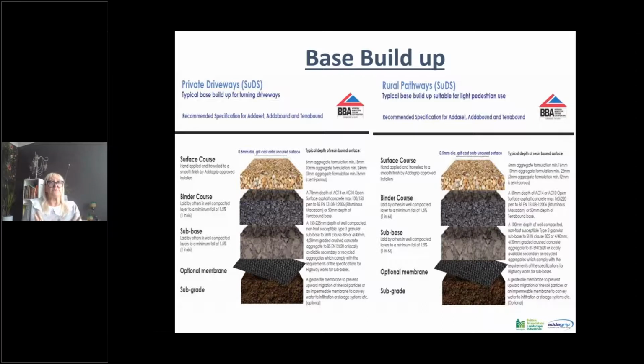We've also got, as you can see on this slide, a 3 millimeter aggregate. This tends to be, we would say, semi-porous. It doesn't have the same permeability because it uses a much tighter aggregate. It has less voids, and therefore you tend to get less water permeating through. So it's semi-porous. But again, these thicknesses are much thinner on the 3mm stone, 16mm for traffic and 12mm for foot traffic. These are used rarely, as opposed to the 6mm and the 10mm application.